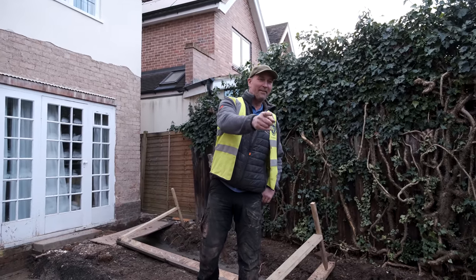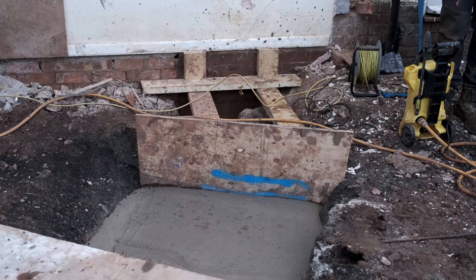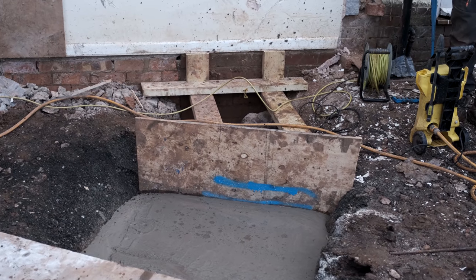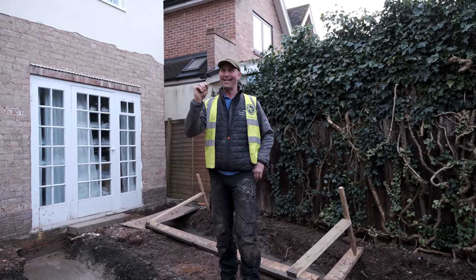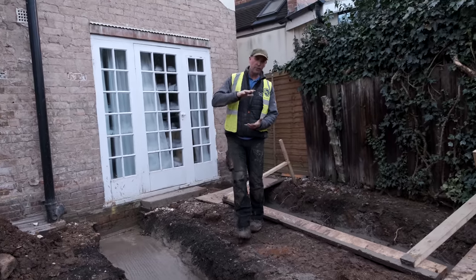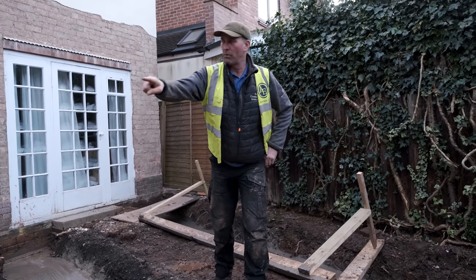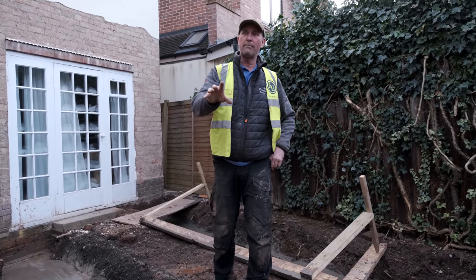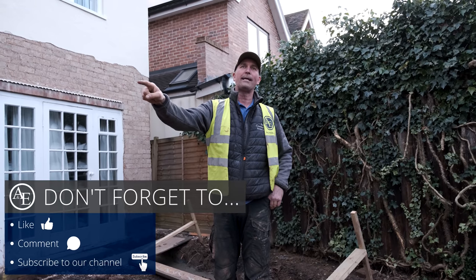So we've laser leveled it all off around here. Over there, we've shuttered either side. We're gonna have to do a dig out underneath there with the underpinning, because obviously we've got a steel line running across. The next phase tomorrow is digging all of this channel out here. We're gonna dig it 150mm below this finished footing line, and then excavate all of this section over here to the same distance. We then start digging out the footings the next day after. Okay, cool. So, here we go.